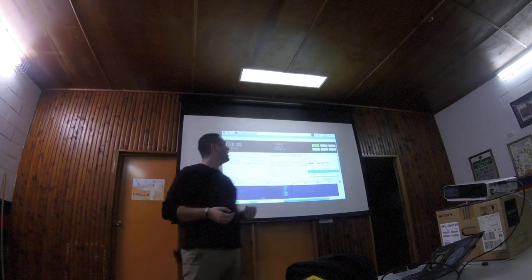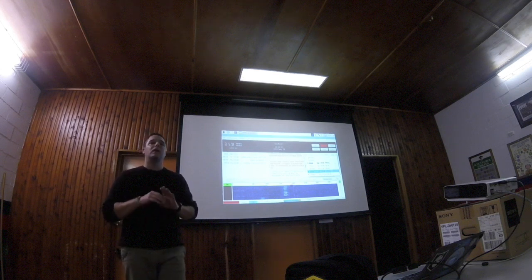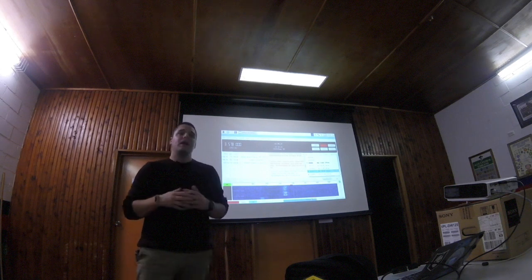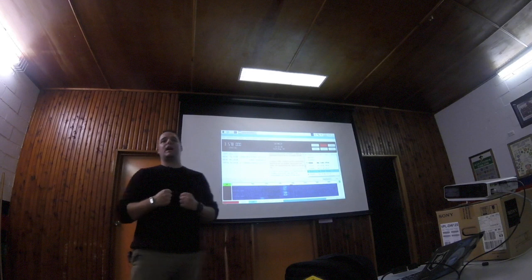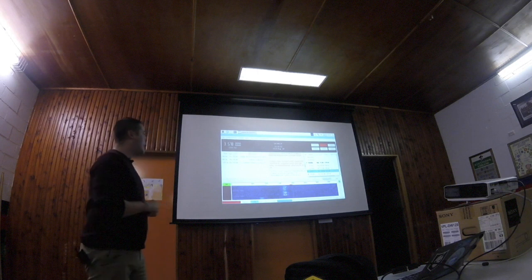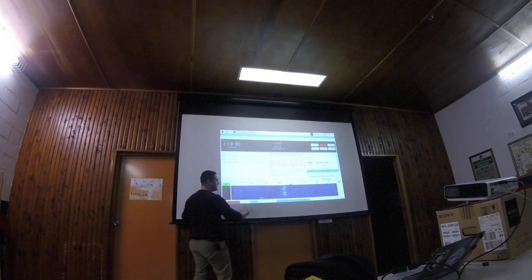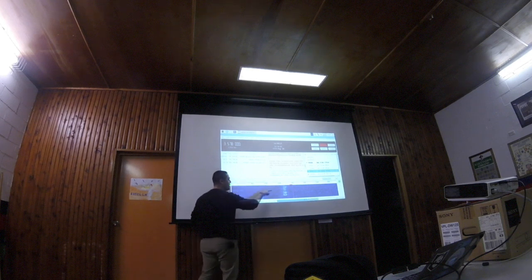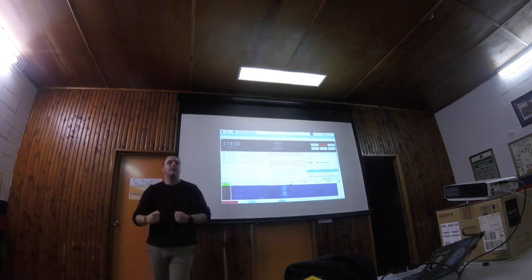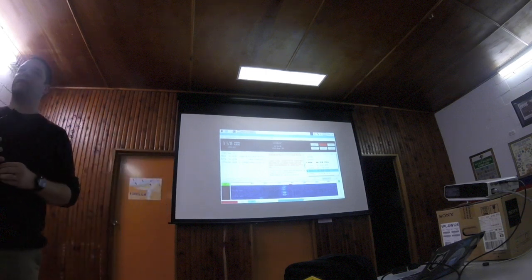On the 817, we're talking maybe 7 seconds for a really low down negative 22 type audio, because it has to use its little brain really, really hard to do some deep decoding, because it'll pass it through 3 times to see what it can get. So these lines here are 15 second chunks as it moves down in time. You might see a message end here before it starts fully appearing up here, because it's trying its little guts out. However, that's acceptable for me in the field.